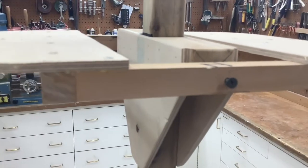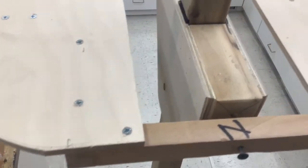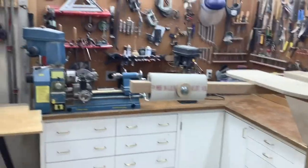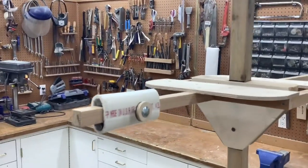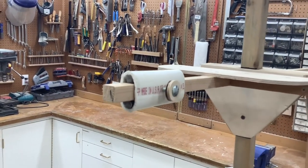The yoke is coupled to the pendulum crossbar by two pivots made from sheetrock screws. A Phillips head brass screw is set in each end of the crossbar. Then a quarter inch diameter conical depression is made in each screw using a drill. The sheetrock screws are then adjusted to make contact with the bottoms of the corresponding depressions. There is a counterweight bar connected to the other side of the yoke opposite the pen bar. The counterweight can be slid on the bar to adjust the z-axis force on the pen. The counterweight's position is adjusted so that the pen draws consistent lines as both pendulums move. Since pen friction is the major cause of energy loss, this force should be minimized.